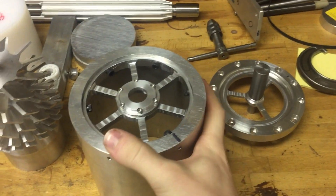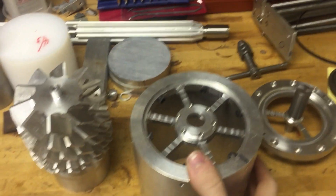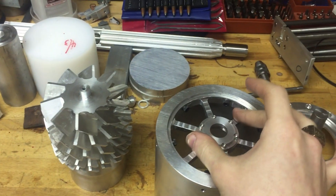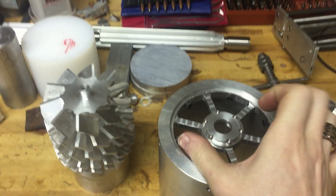And this is what I'm working on right now. It's a turbo-molecular vacuum pump. Turbo-molecular pumps are a kind of vacuum pump that is designed to obtain extremely deep vacuums, much deeper than you could get with any kind of traditional mechanical pump.